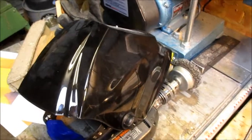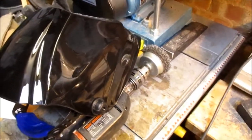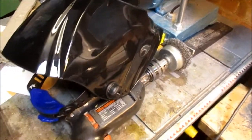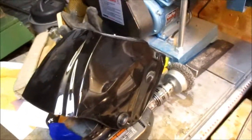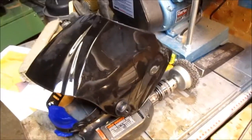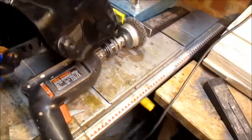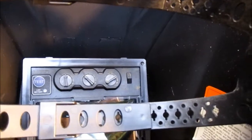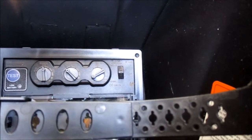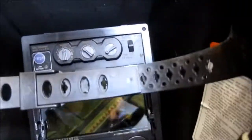Basically the thing wasn't going dark enough initially — still pretty bright. Fortunately I only did one little squirt of arc and thought 'that's too bright,' so I adjusted the darkness and then had a careful look and saw the switch. A YouTube video said you adjust the darkness so you can see what you're doing and it's not so bright that it dazzles you. Just a word of warning — I did read the instructions, but it's a black switch on a black background with lettering that's almost invisible. It's just to the right of those three knobs. Once I'd sorted that — absolutely brilliant, total game changer.